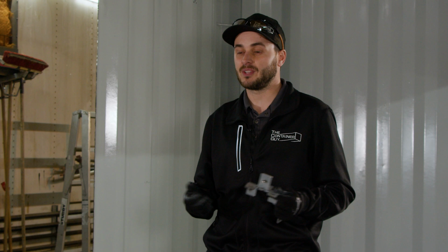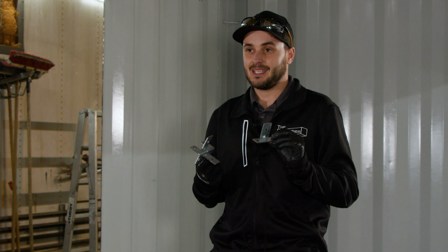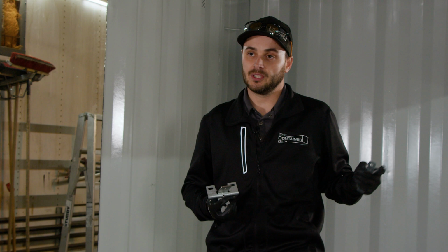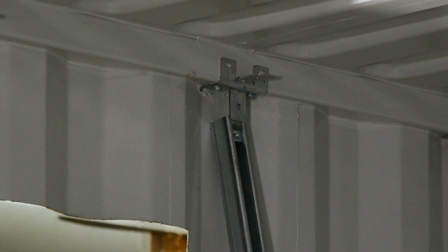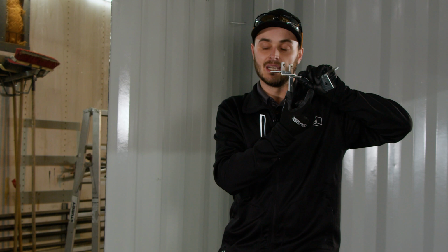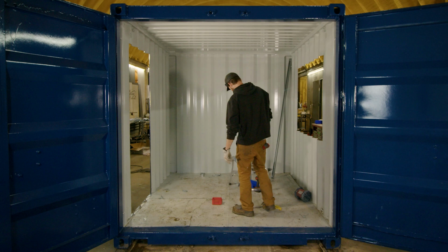What I'm excited to showcase in this is these modular strut system, we call them MSS brackets. We have the single here, which is meant for the floor and also potentially terminating either up at the top tubing, a strut that only goes along the wall and doesn't continue across. But if you know you're going to be going up the wall and across the ceiling, then there's this MSS double. In this instance, the 60 millimeter tubing would be right here, and this is perfectly aligned. It allows you to install a vertical strut and one horizontally, and perfectly spaces it out so that it can be installed either in the non-insulated or the insulated position. So we're going to get at this right now. William and Curtis will start strut lining this. We'll follow along and show you how these work.